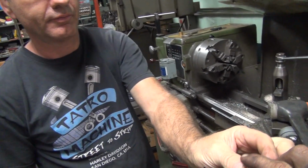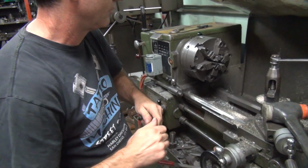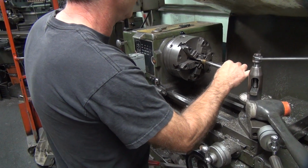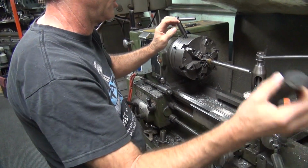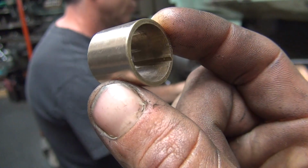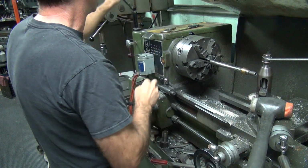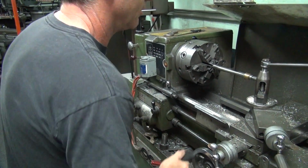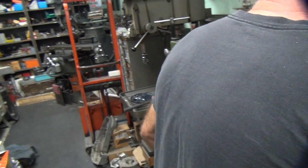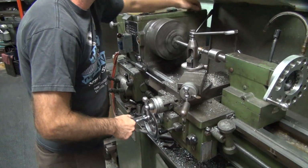There's your missing bushing you couldn't find. Wow. What was this originally for? Some kind of cam cover. Austin Forster cam bushing. Yeah, it's got this oil groove in it. A whole box full of junk ones over there. Went to the scrap box. That's why you don't throw away your stuff. You never know when you need it for something else. Right. Well, that's why I kept that other one. They were junk cam cover bushings, but great brake vacuum type bushings. Yeah. After you do a little light machining. Well, you know what? I couldn't have done that at home.